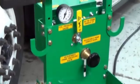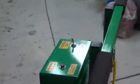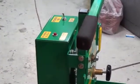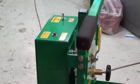Now on the control panel, we have a little red indicator light. This indicator will come on after about 2 minutes and 15 seconds of the prime. This engine requires a 2 minute prime, but we give it 15 more seconds for the fuel to fill the module, so we get the full 2 minute prime at the high pressure required.